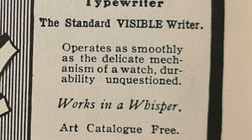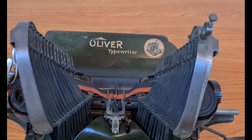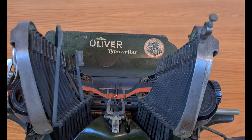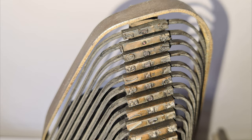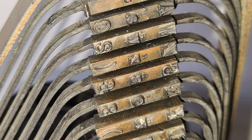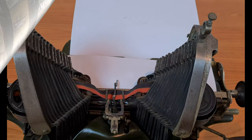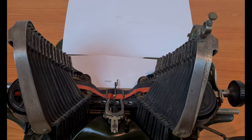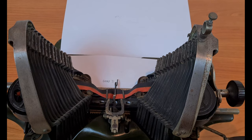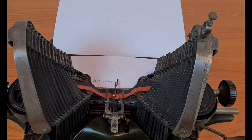The typing bars hit the roller quite hard. The typing bars are stored in two towers on the sides of the typewriter, and become progressively larger as more were added. Since it's not possible to add many more typing bars, on every bar there are three characters, and the keyboard is limited to three rows of buttons. Thanks to the fact that the typing bar hits the paper downward, helped by gravity, the typing bars hit the paper with considerable force, making a clear impression. Also, the force required to type was less than other typewriters of the period.